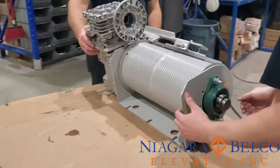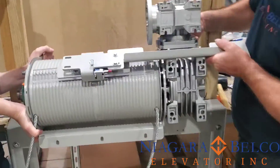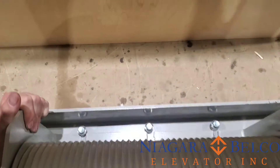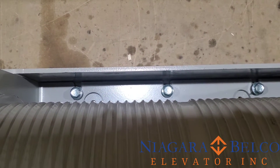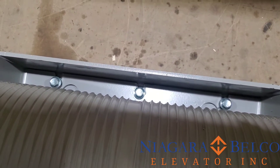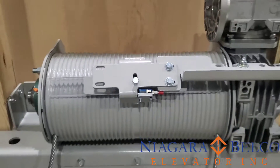This assembly is about 120 pounds — you're going to probably want two people. Now it's in place, sliding those slots underneath those bolts. Because of the access behind the drum and obviously you've got a hoistway wall at the back side of that shelf, you're going to want an extension on your ratchet and reach down — you should be able to grab those bolts without issue. We've tightened the front three bolts, which the access to those are fine, and we've tightened the back bolts that we mentioned, that you slid underneath.